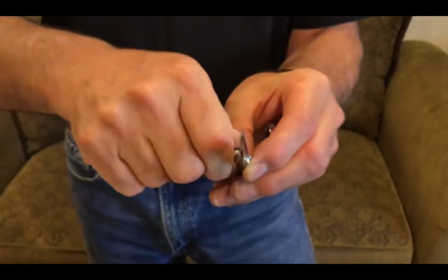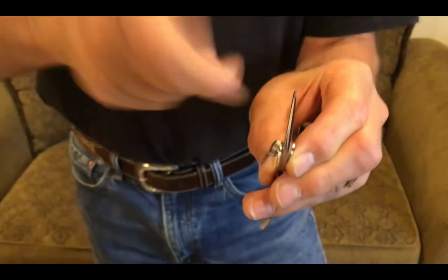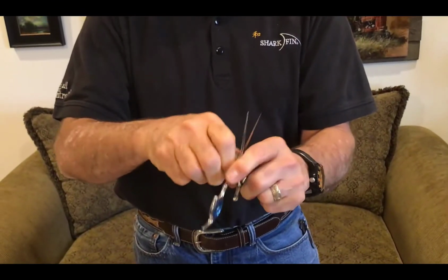The way you'll know if you've got the click plate facing up, the bump in the right way, you guys hear that? It should be clicking. So if you put it back together and you make it tighter and it's not clicking, you have the click plate upside down. Take the knob off, flip it over, put the knob back on, and then we're going to adjust blade tension.